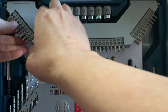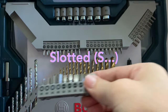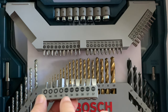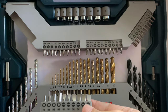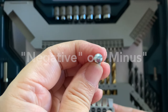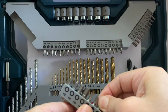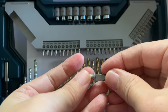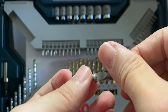Now let's get to the various types of screwdriver bits. Let's start with the slotted bits. They are designated with S, or slotted, and the suffix number increases as the tip width increases. This is used for screws with slotted heads, sometimes called negative heads, as it resembles a negative sign. This is the simplest but oldest screw design. The disadvantage is that it's not suitable for power drivers, since at high speed the driver bits can slide out.